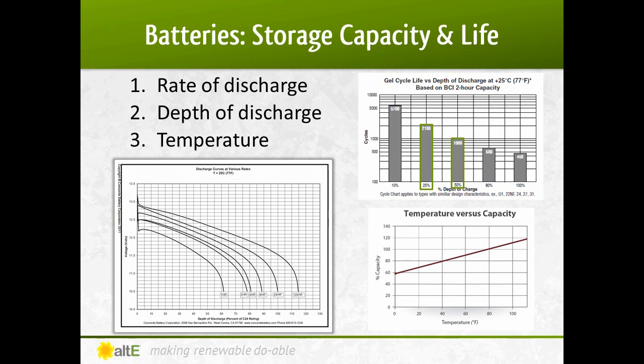That's over twice the life by using half the stored power. You can also see that battery capacity is rated at 77 degrees Fahrenheit. If you store the batteries at a colder temperature, say 60 degrees Fahrenheit, your capacity drops to about 90% of its rated capacity — so instead of holding 92 amp-hours, it will hold 82 amp-hours. This drops even lower near freezing: at 35 degrees Fahrenheit, capacity drops to 78%, making your 92 amp-hour battery effectively a 71 amp-hour battery.